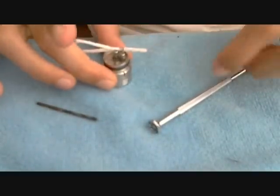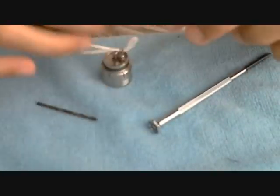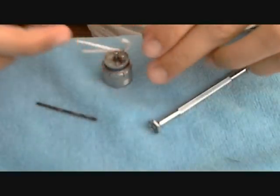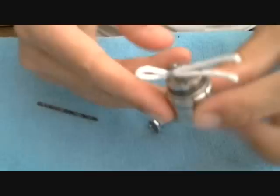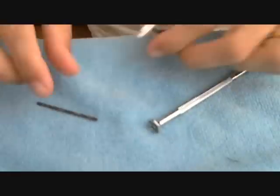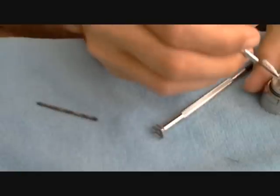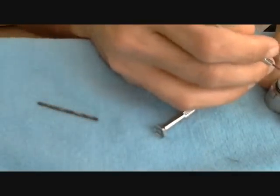Coil's through. I take my resistance wire out now. Oh, I'm sorry. Non-resistance wire that I'm using to pull it through. Unwrap it real quick. There you go. Cotton wick. 0.08 ribbon wire. I'm just going to give it a quick space with a little flathead here. Make sure none of these coils are touching each other. This is going to be spaced out just a bit.